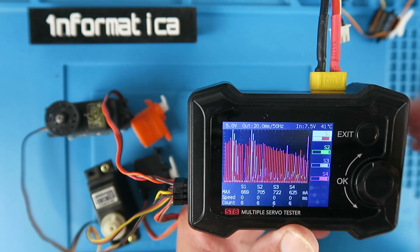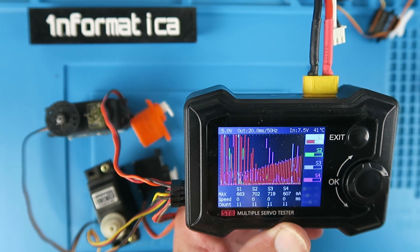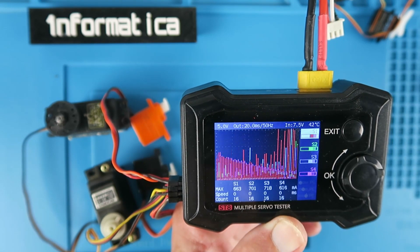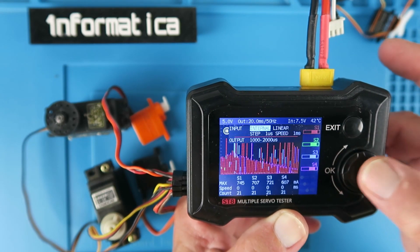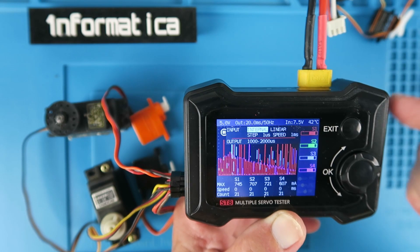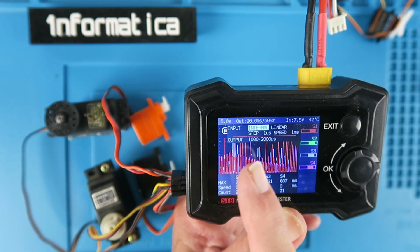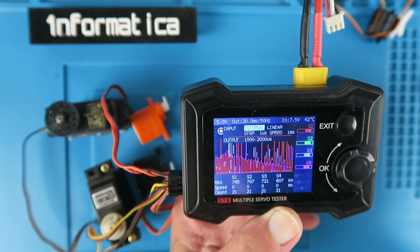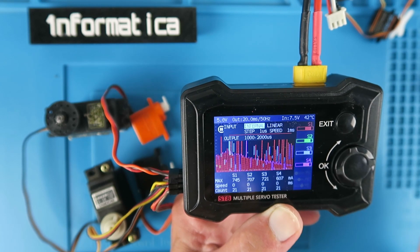Just out of amusement, I've connected up some really old servos - I think these date back to my 27 meg days, so they're a good 30 years old. Still only drawing around the top end of 600 milliamps, obviously on no load. In this video I'm not going to go through all the detail of all the programming that we can do - there is a multitude of things. Changing the input modes to SBUS, PWM, or PPM. Being able to change the step and the speed. You can set it below 1000 microseconds or 1 millisecond and above 2 milliseconds, set the beginning pulse width, the centre pulse width, and the end pulse width individually as well.